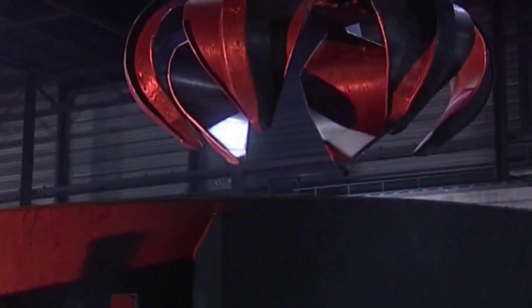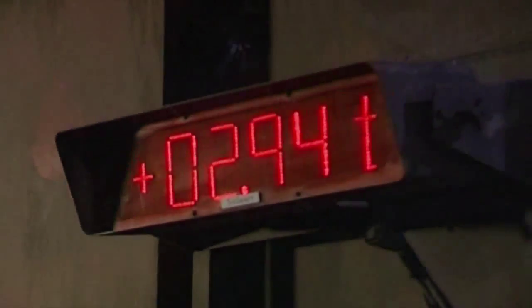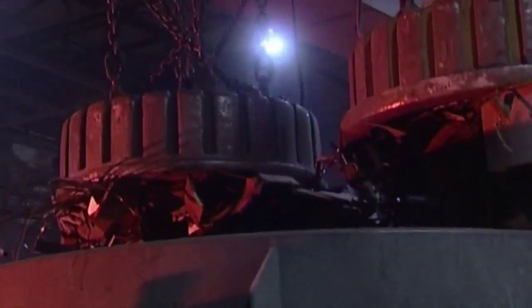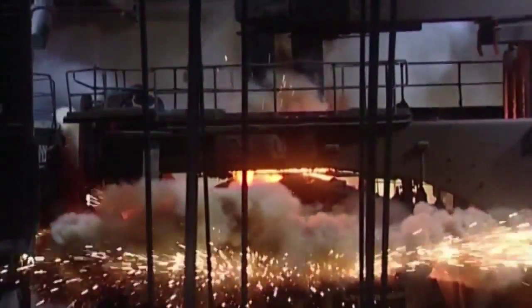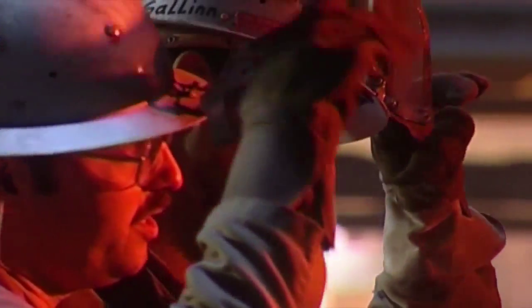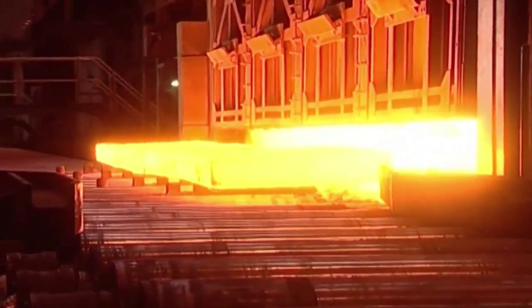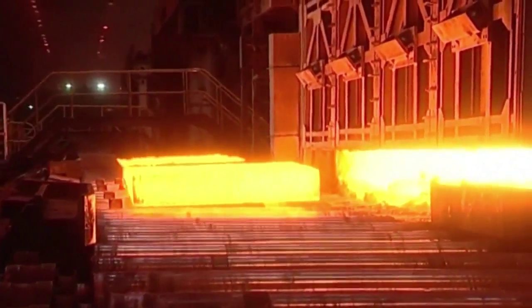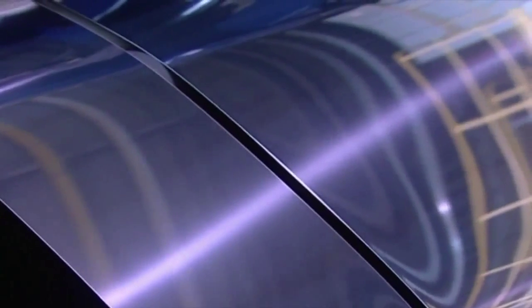It's a long way from the raw material to the finished dispenser. The arc melting process used to transform iron ore into stainless steel by admixing alloying elements reaches temperatures of 8,000 degrees Celsius. Still at 1,100 degrees Celsius, the material is poured into blocks and subsequently, in a steel mill, rolled into thin sheets, cooled down, cut and coiled.